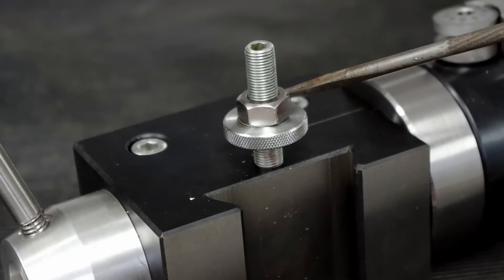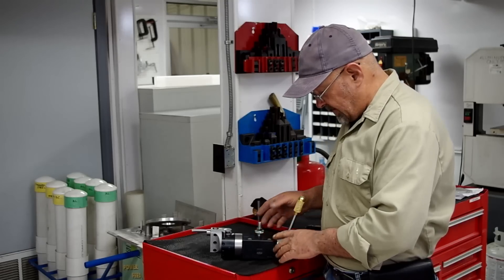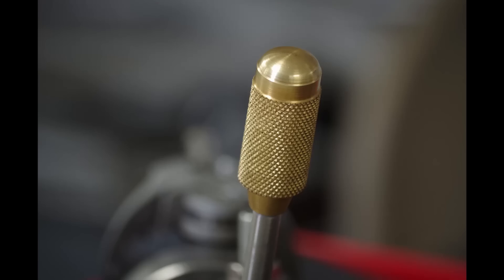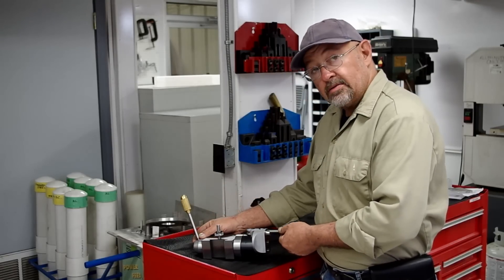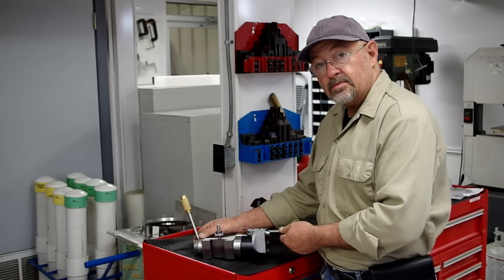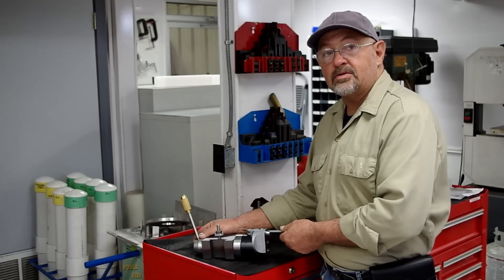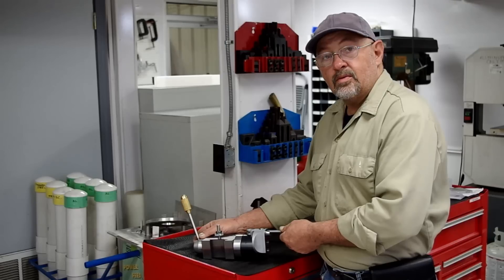I set the height. It was a little tricky to set, but once I got it set I shouldn't have to move that. This is just a piece of aluminum I machined out for a cap. This is a 3/8 bolt — I cut the head off, threaded the other end, and this little brass knob was something I had left over from another project. It works pretty good. I went ahead and shot some clips on the lathe making a couple of cuts — a full hemisphere cut on one end of an inch and a half 6061 aluminum rod, and on the other end more of a large radius cut, similar to what you'd see on the end of a ratchet handle. So I'm going to throw these clips together and we'll see what it looks like.